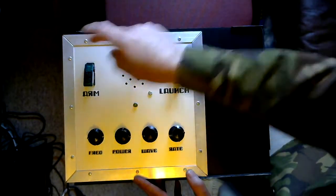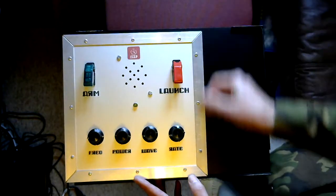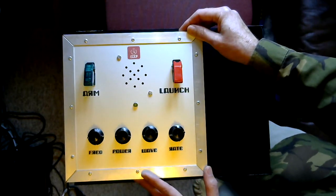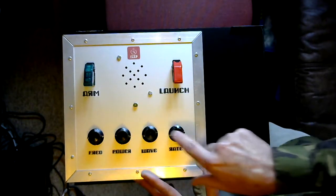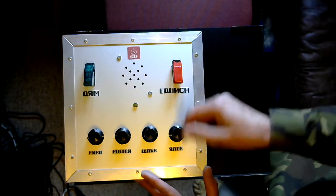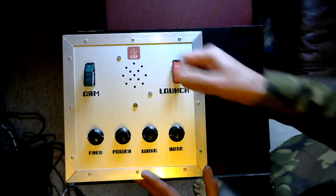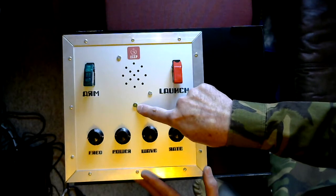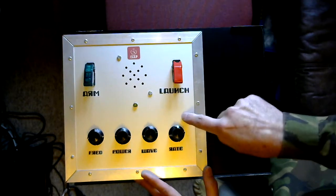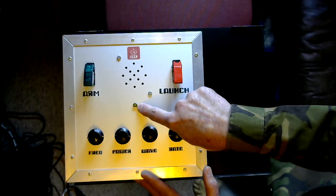The top panel, it's just an aluminium sheet, and I've edged it with what is actually the kitchen unit trim from the DIY shop. The little knobs here, I got these from an electronics surplus shop. These are off some really old equipment, and I had to re-tap the holes for the locking screws so I could get metric grub screws in there. There is one other item here. There's a yellow LED in the middle of the panel here. That's linked to the output from the LFO, so as the speed of the LFO increases, then the flash rate of this LED will increase.